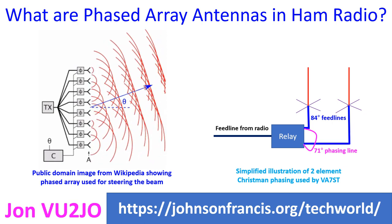In the illustration, a computer-controlled phase shifter changes the phase of the signal fed to each element. The progressive delay in signals would in effect change the direction of the superimposed signal wavefront to an angle depending on the phase shift given. By altering the phase shift, the angle theta at which the beam is radiated can be changed without physically rotating the antenna.